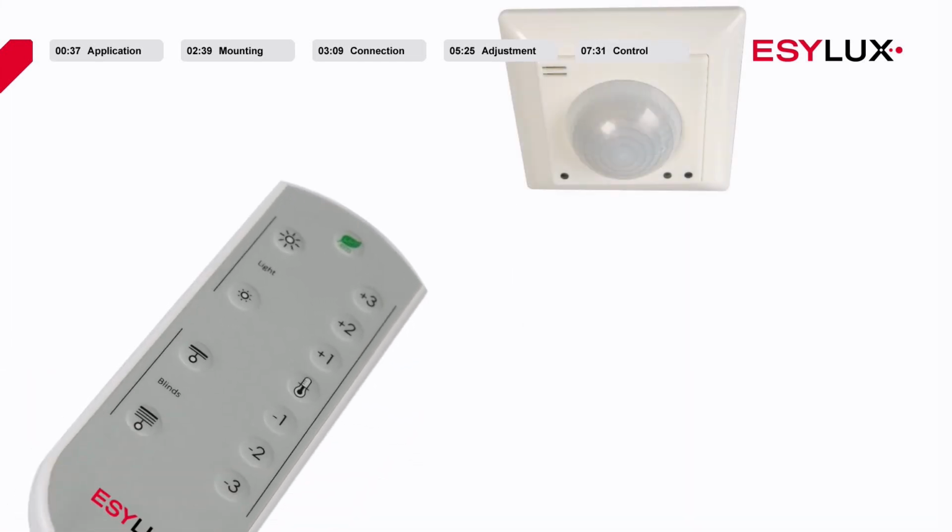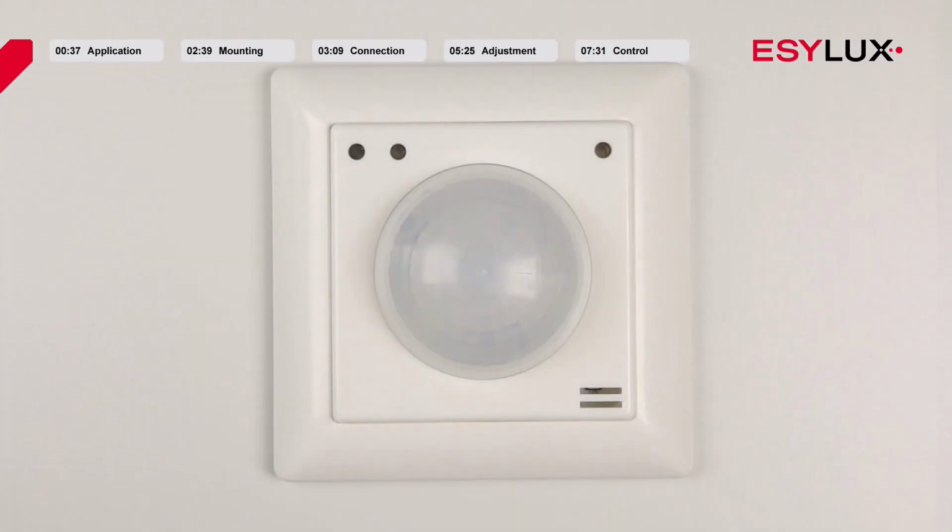Point the remote control to the multi-sensor and use the up and down buttons for remote control input 1 to control the brightness of the lighting. Shutter blinds can be controlled using the remote control input 2. On the right-hand side of the remote control, the temperature can be increased or decreased by up to 3 levels above or below the target value. A red LED flashes when the detector receives a signal from the remote control. The detector also features an LED to indicate either the heating or cooling status.